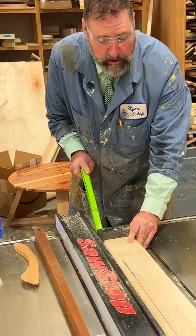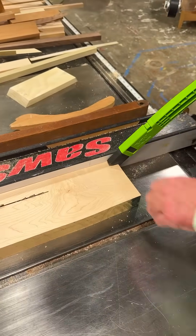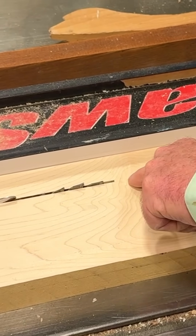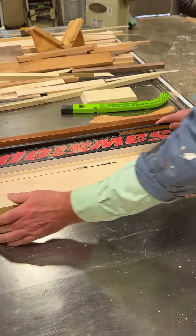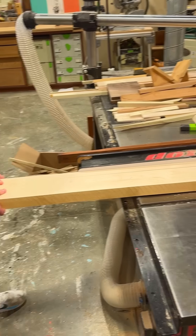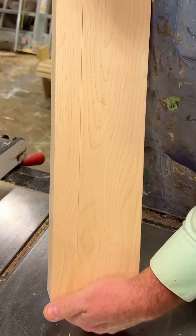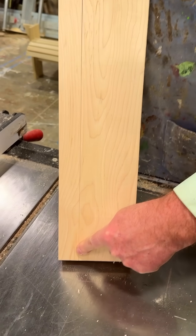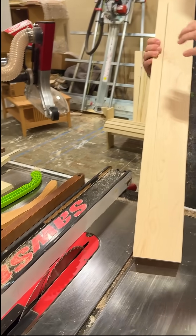This is some reaction wood right here. This particular piece of wood — if you zoom in — I cannot push this piece anymore. It is stuck, and it's because of this funky grain that you see right here. So what I'm going to do is lift this off, and you can feel how tight it is. Lift up on it on your end — you get more leverage than I have. This is a great example: this piece is pinching all the way tight on this end, and up here is where the saw kerf is.